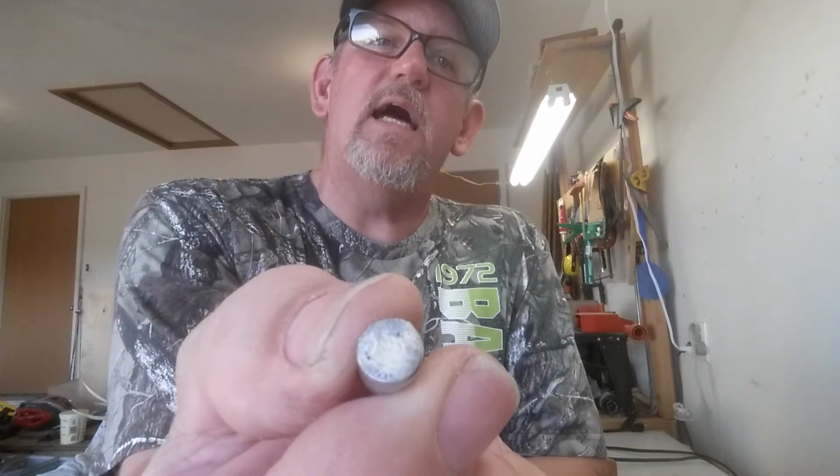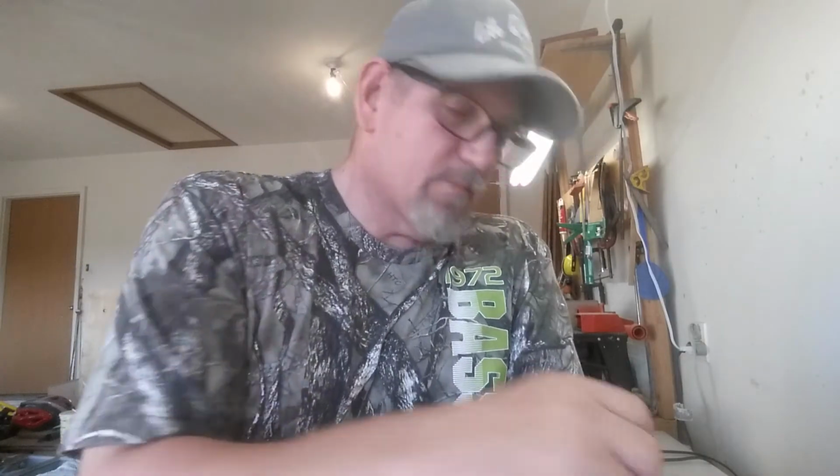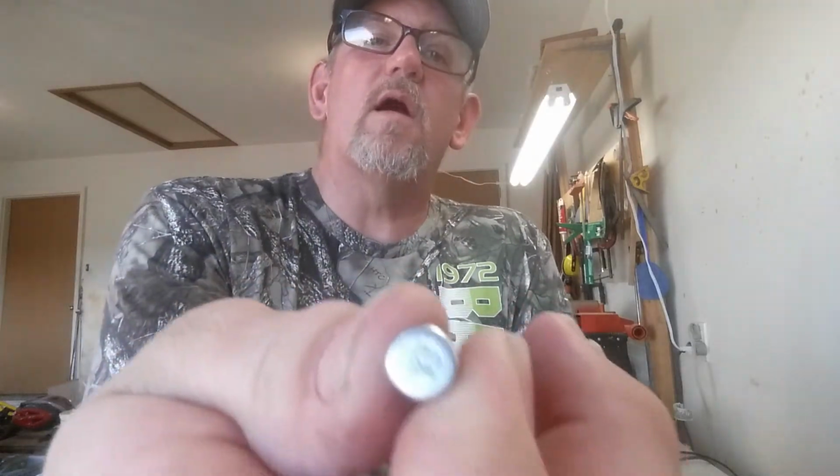But what happens is I get in a hurry to get these bullets going, and I just cast so fast that it heats up the mold to almost match the temperature of the metal. And I need to learn to slow down a little bit, knowing that I cannot turn my pot down to make the metal cooler. And so with a little patience, you can have bases like that. Just smooth. Smooth bases, no tear out.